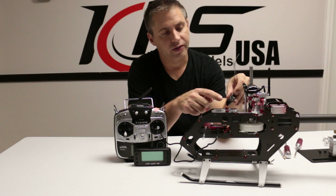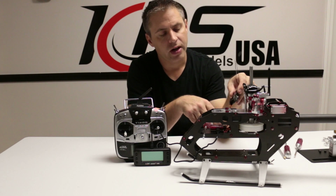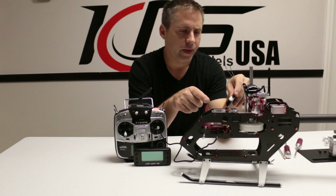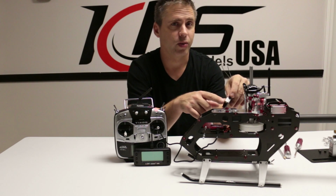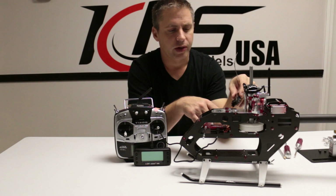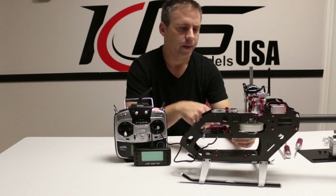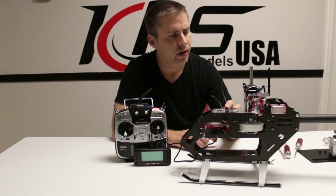It's aileron, elevator, rudder, signal only on your receiver, and that plugs into the AER channel on your Ebar. You'll also use a jumper from your pitch channel, which on a lot of full-size receivers is usually aux1, and that plugs into the pitch ESC port on the Ebar. Most of us are plugging our speed controls directly into the receivers.